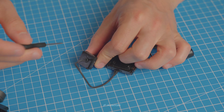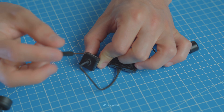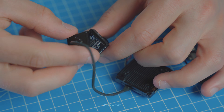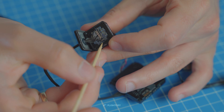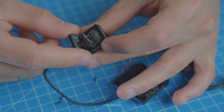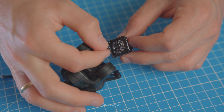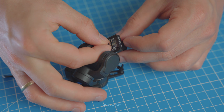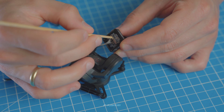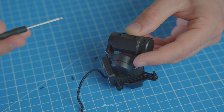Let's prepare this set for operation. First, you need to use a small screwdriver to unscrew the camera cover. Inside, disconnect the coaxial cable connector — I always try to do such tasks with a soft wooden toothpick to avoid damaging anything. Next, take the camera and plug the coaxial cable connector into the gimbal. The camera needs to be screwed to the back of the gimbal housing.